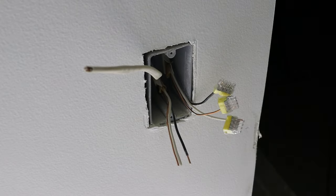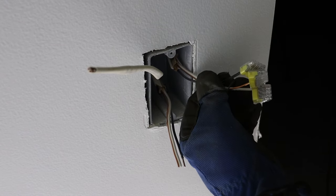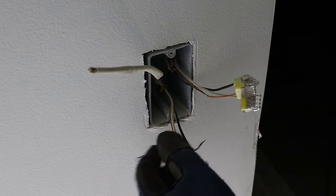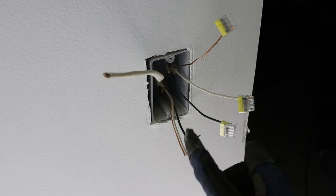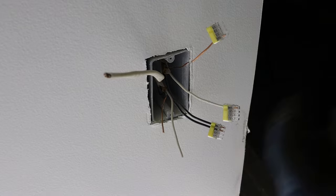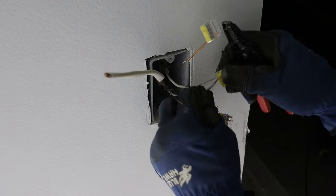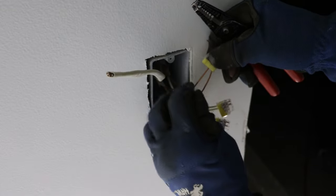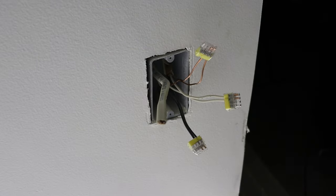So this wiring in the office switch is a little bit more involved. I had to make the lights hot out in the main room and so I put these covers on here — these are actually hot when the breaker is on in the panel box. These wires continue on to make the next switch hot, and then this is the switch for the office light. This is the Romex coming in — this is our hot. This is the Romex wire that needs to continue on, so we know we can just connect the hots up. Basically what we've done is just bypass the switch so it's going to stay hot on to the next switch. You can just connect the neutrals and same thing with the ground — essentially all you've done is connected the Romex up to continue on to the next switch.